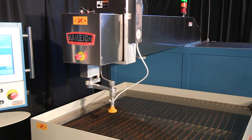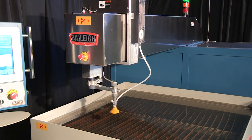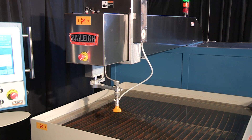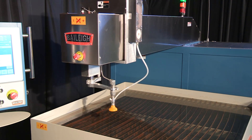Now we've got the machine cycling. Just so you know, the Z axis on here has up to 170 millimeter travel. This machine can cut mild steel, stainless steel, glasses, porcelains, plastics, you name it. 55,000 PSI — that's a lot of power to cut almost anything with perfect edges.